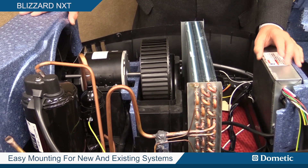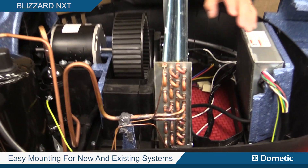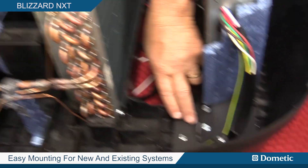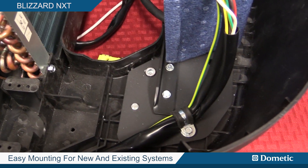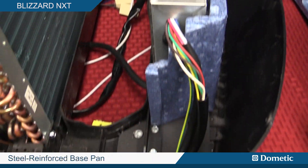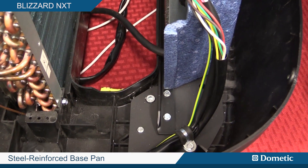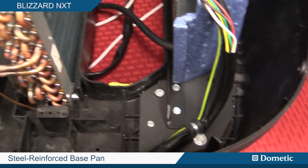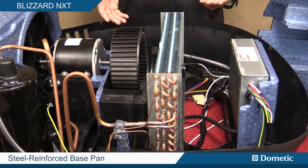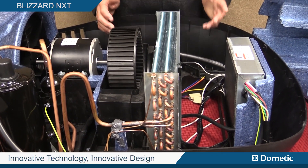The other thing we've done for the OEM from an installation standpoint is it installs exactly like the current product of the old design that we make today — it installs from the top with the same hole locations. We've also added rigidity of steel molded into the plastic on the bottom side, and that gives us the rigidity we need while still being able to use plastics and injection molding the plastic as opposed to vacuum forming.